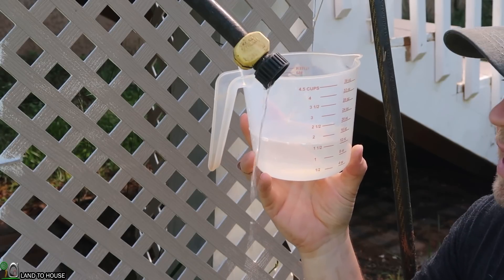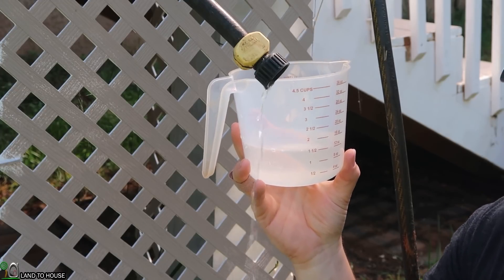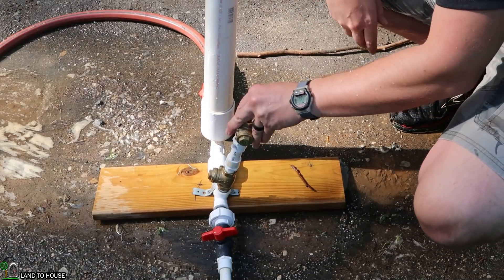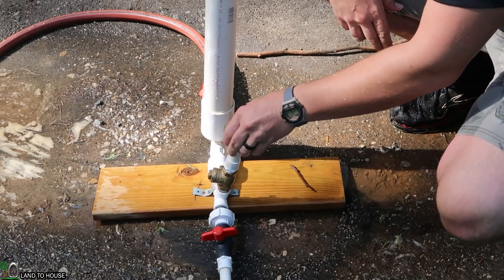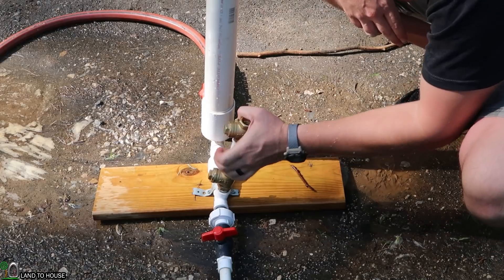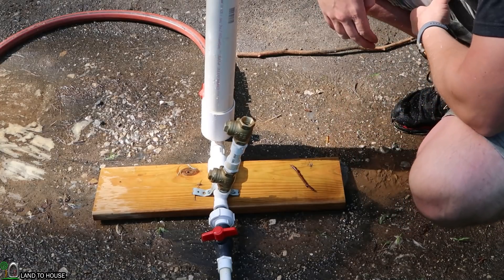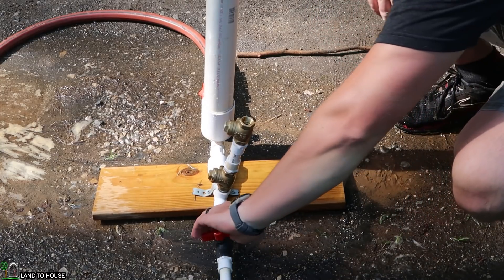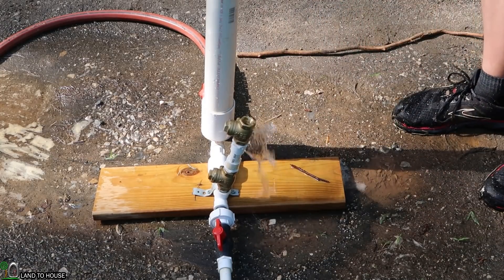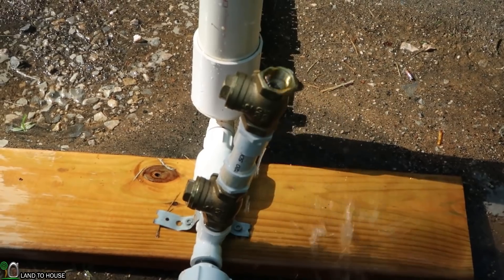Let's walk down to the bottom and add the additional valve, then do this test again. Going ahead and turning off the drive pipe to add the second valve, making sure it's oriented in the same tilt as the first so it will close easily. There we go — we've got a stacked waste valve. I sure hope I can replicate the results from that video. And it works — you can see two valves operating, hopefully in unison.